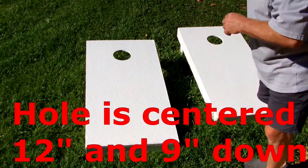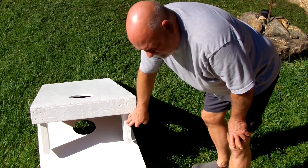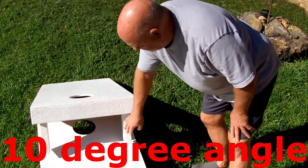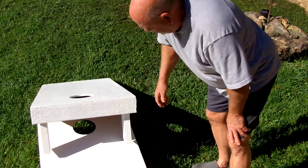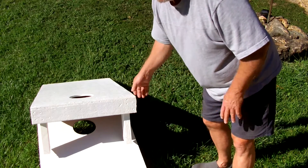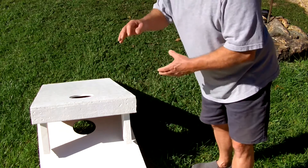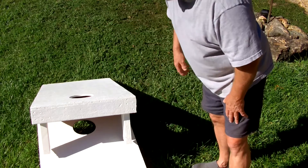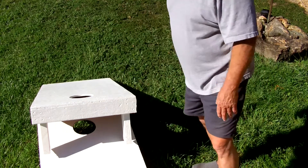I just drilled a hole in the middle and I cut some legs about 11 and a half inches. I cut a little 10-degree bevel on them so they sit flat on the ground. I didn't do anything fancy with the legs — I just screwed the legs in hard. The instructions showed it folding the legs back under, but I didn't really care about that.